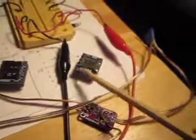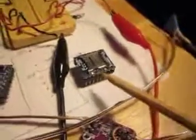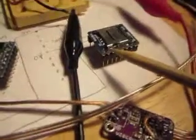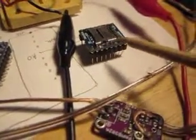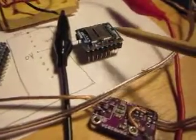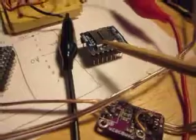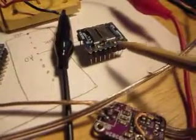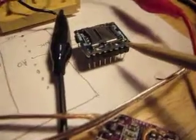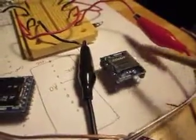Well, what I found is a couple of things. The soldering connectors here are all so full of solder that they are actually shorting against the metal plate here. So when I move this back and forth to lock and unlock and do what I have to do to get the SD card in there, this is somehow rubbing very violently on the metal part, so it's not allowing it to slide, and it's the same on both sides.